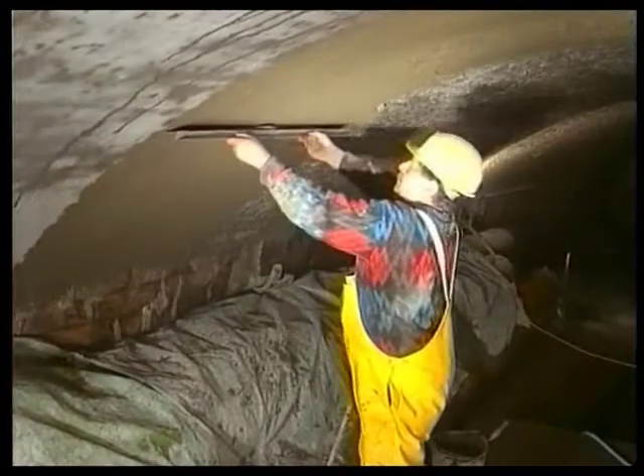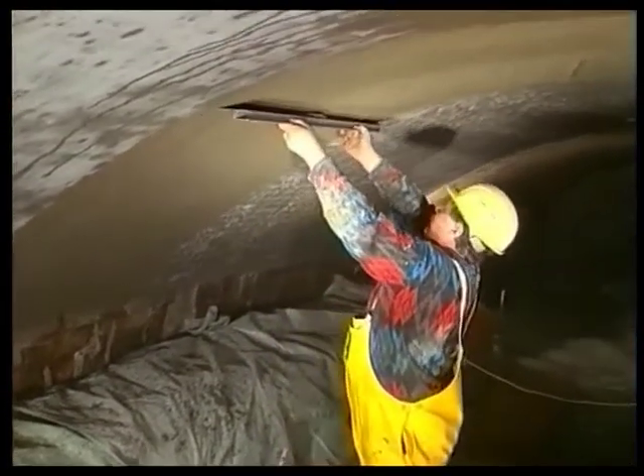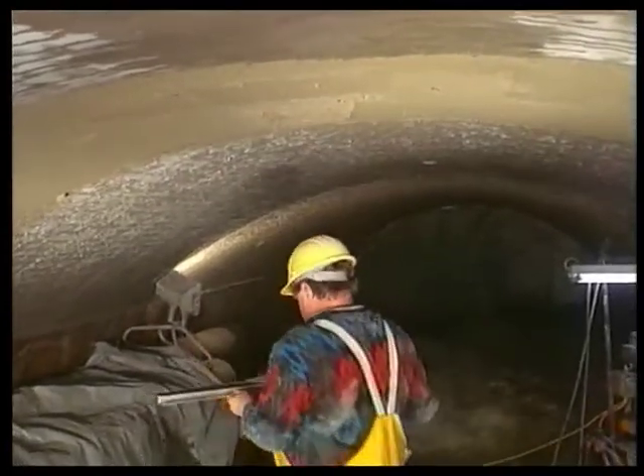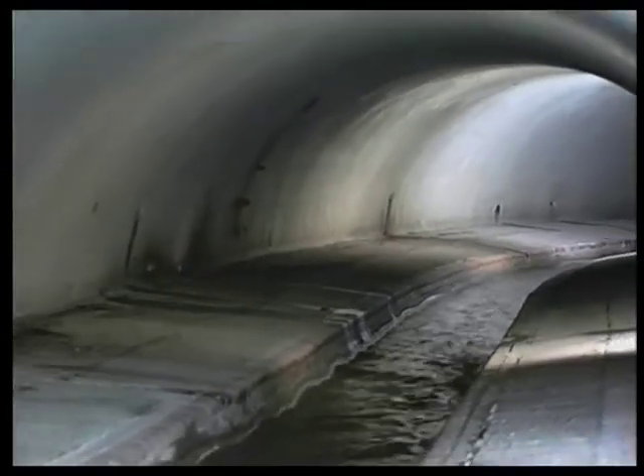The layers are applied with a fine mortar spray gun at a pressure of about 20 bar and 10 millimeter diameter nozzle. The final layer is troweled smooth. This municipal sewer was totally reconstructed and the entire internal surface coated with Vandex products.